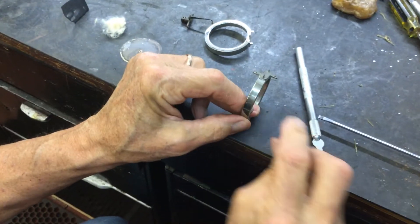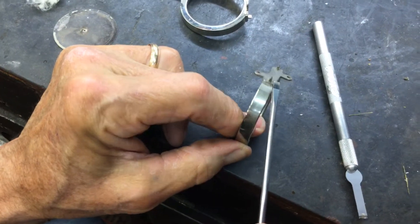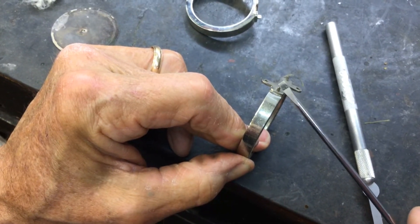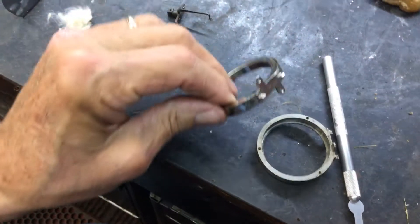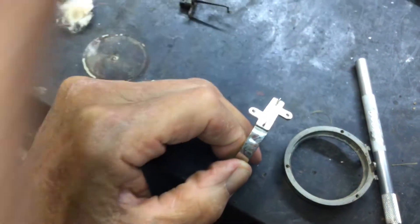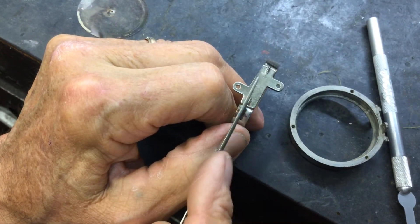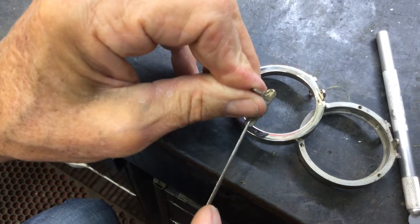The other thing is your reproducer part — you can see this one here. You see this nipple that comes up? That's where the needle bar fits. You see how the sharp point is right there? That's where it fits into the needle bar slot. You have to make sure those points aren't rounded off. This one was kind of rounded off, so I'm taking my diamond file, or any jeweler's file, and I'll refile those down to a point so they fit into the needle bar slot.